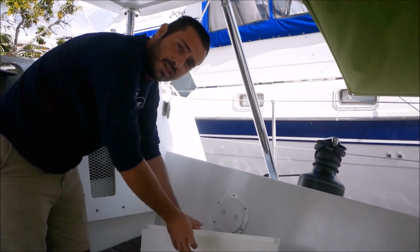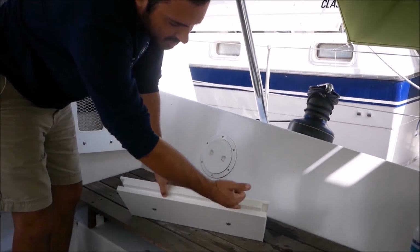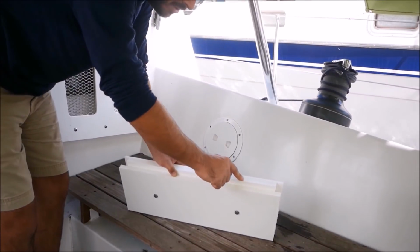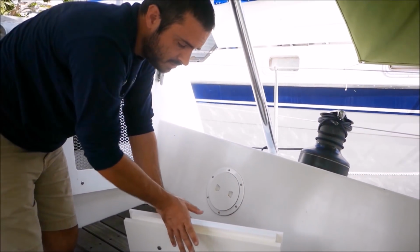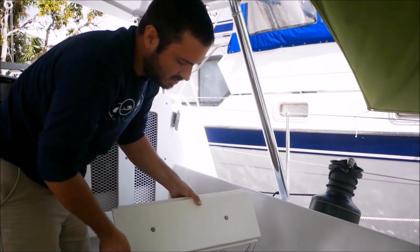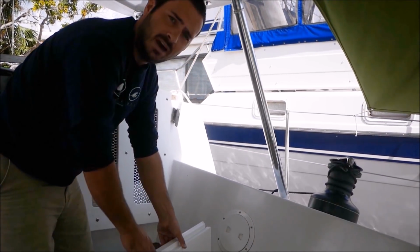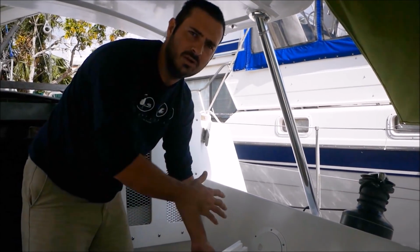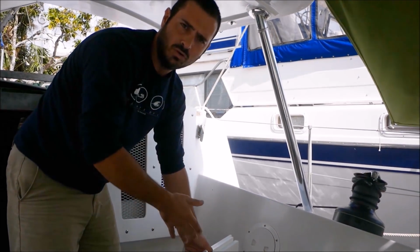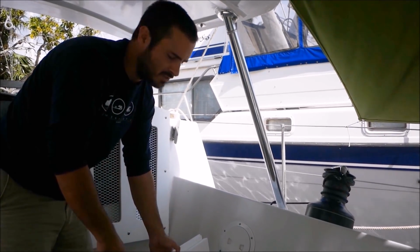Okay, so the bottom board, the filler piece that's going to be in majority of the time, is a sandwich piece. As you can see, I haven't bolted it completely. It's just 2 bolts holding it together for a temporary basis. But we have 3/4, 3/4, and a 3/8 piece of starboard. Pretty darn heavy. But when it fits within the track that's for the typical companionway, it creates kind of a good water seal, so we don't have to worry about rainwater getting in. Again, the whole idea with this is that we can remove it, store this door, and put in our actual acrylic drop boards when we need to, if we're into heavy weather type of thing. So it's just an in-harbor type thing.